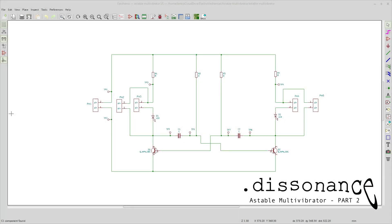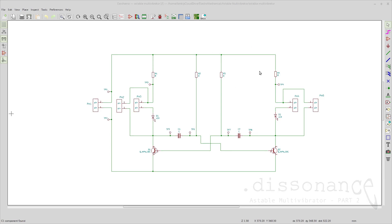Before I go ahead and start associating everything here, we need to determine what we're going to do. For example, these resistors — which ones are we going to use? I don't need to really pick these out specifically. I do know that I'm going to go surface mount for pretty much all of this stuff, so these are going to be 0805s. That seems good.